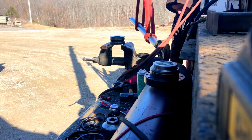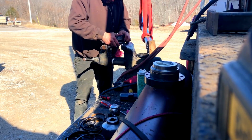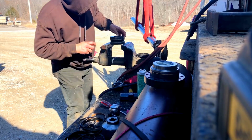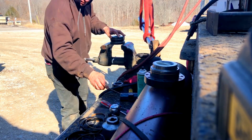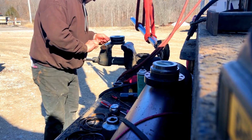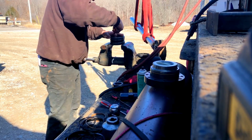So I'm gonna pluck it out of the bake oil, and then I'm gonna try to shove it on the piston. And it's gonna snap on tight, and it's not gonna work. I'm gonna have to use O-ring picks, and I ain't gonna be able to find the right pick, and then I'm gonna freak out because the whole time the ring's sitting there cooling off, and it's gonna be stuck tight, and I'm gonna put dings in the ring, which is not good. And that's why I'm kind of working a little bit on the frantic side.